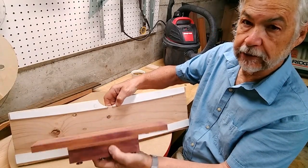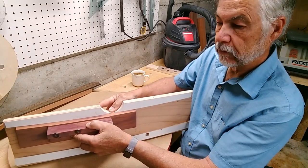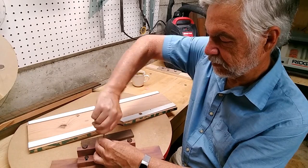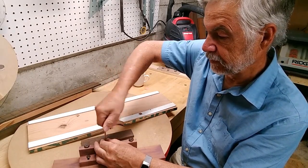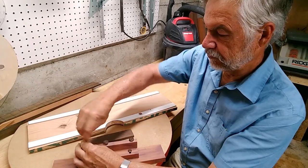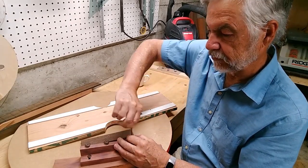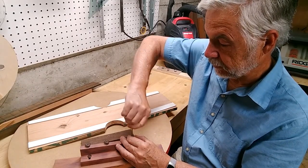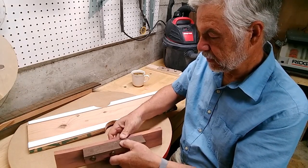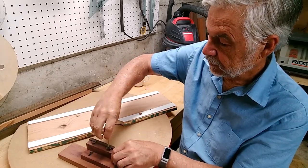And I have another jig that allows me to run at that angle. I have conveniently threaded the purple heart on this particular piece. This is all purple heart, by the way, in terms of the jigs. One thing that's nice about purple heart — and there are other hardwoods that work very well this way — is you can thread the wood. It's very hard and quite cohesive, and you can use rather large-headed bolts for hold-downs.